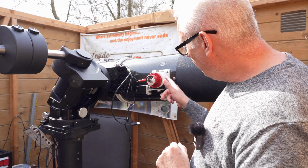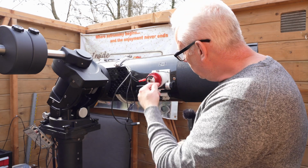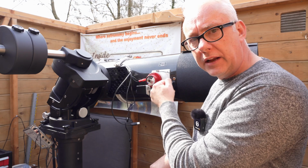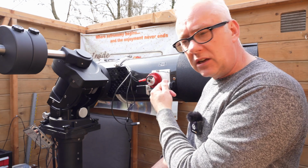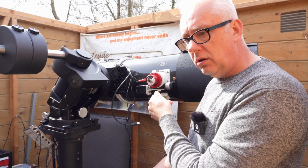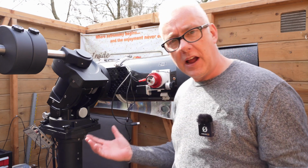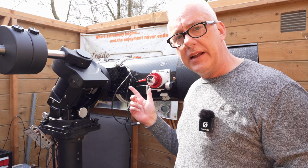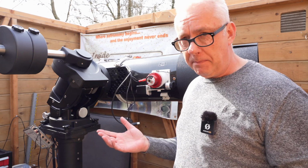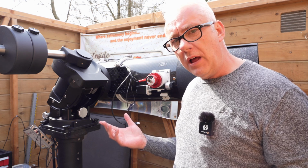is if your focuser is perfectly orthogonal, i.e. at right angles to the optical axis and perfectly lined up. Otherwise, again, simply using a laser collimator like this will miscollimate your Newton. And in fact, I'll tell you right now, with the fast telescopes that I use, I never put a laser collimator near them. In fact, that is true for both epsilons that I own,